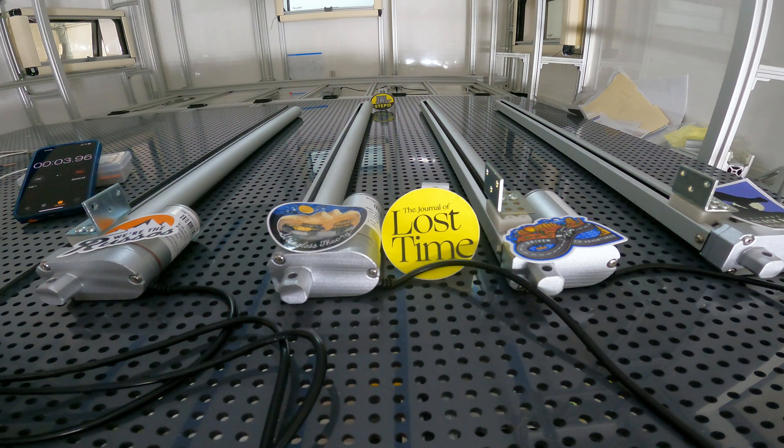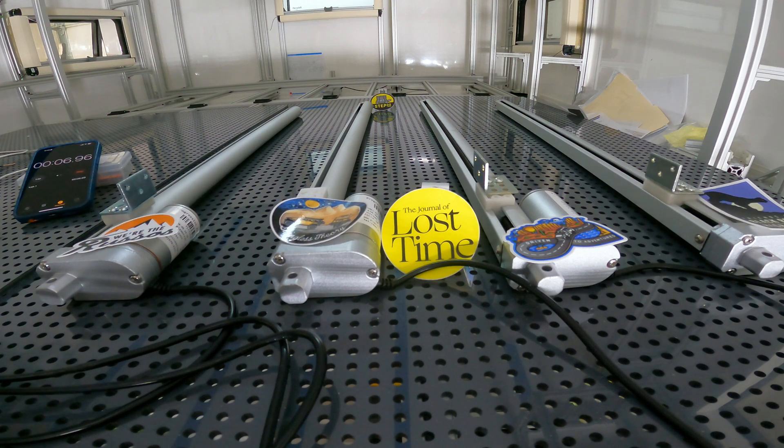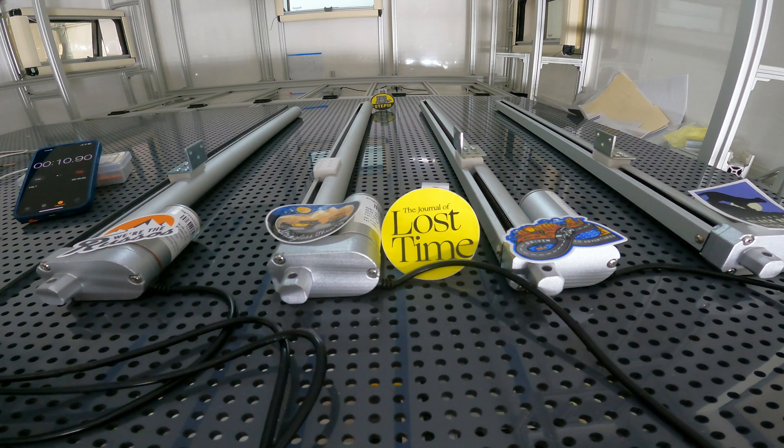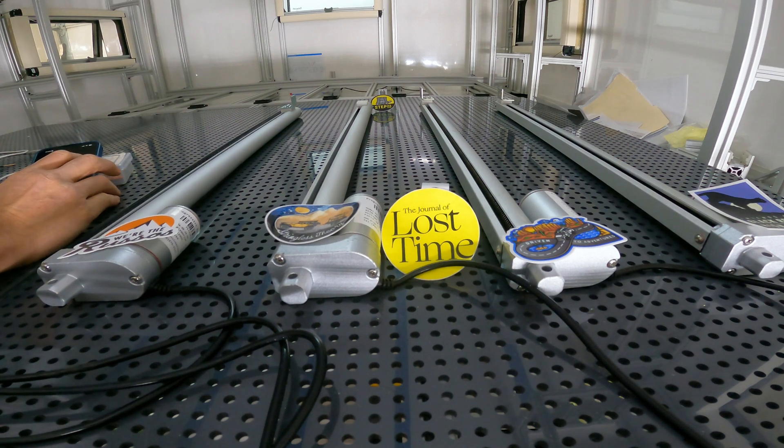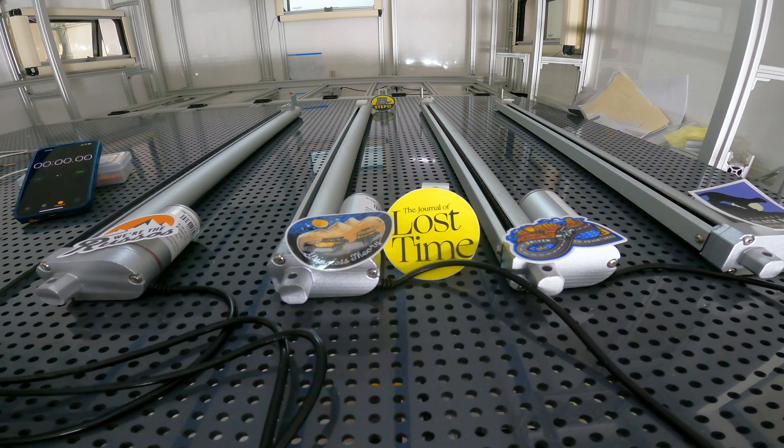And nothing — that might have been the wrong direction. Let's try the other way. They're all going in the same direction, which is one benefit of using a switch: it simply reverses polarity, so how you hook up positive and negative almost doesn't matter — the switch just changes direction. It looks like three are leading with Swingless Siri following at a gradual pace. You can see the 10% differential speed really matters when trying to get all these actuators moving in synchronicity.